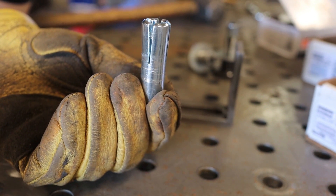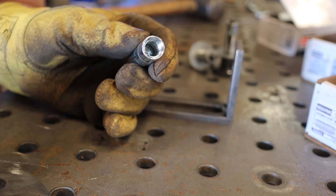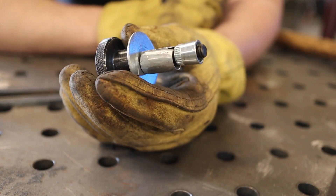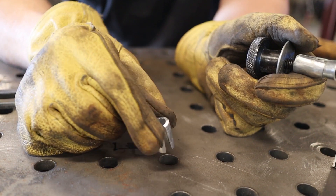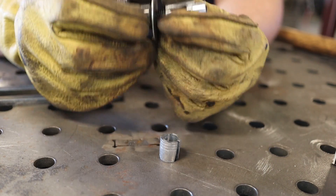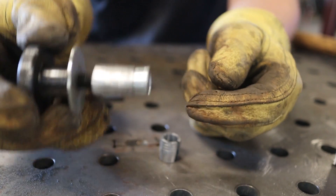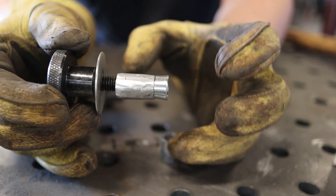You can see how it works - the anchor has mushroomed out and that little pin in the bottom has been doing the work. From the top, there's a little plunger that this pushes down to make it expand. Great for concrete, not great for a fixture table. The next concrete masonry anchor I tried calls for a 5/8 hole, but it's meant to be beat in for a masonry anchor - it's not meant to slip in and out. So I grabbed a flap disc and machined it down so now it'll slip inside the hole. We can try to get this collar and plunger to slip over and expand to lock into one of these holes.